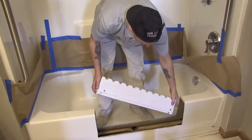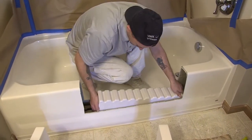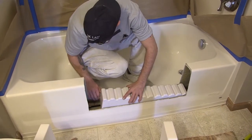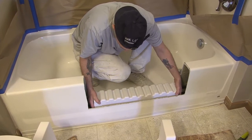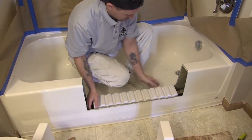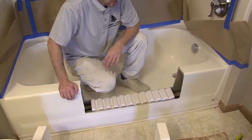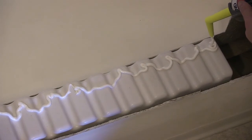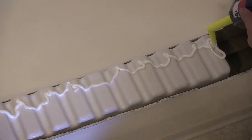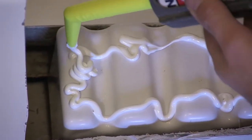Place the SureStep product into position once more to inspect the fit and position — this is the final opportunity to make any adjustments if necessary. If installing the SureStep Combi, install the waterproof wrap membrane after completing the support structure assembly. This step does not apply if you are installing the SureStep Mono or Mono Low. Apply adhesive to the top of the large support box. It is recommended that an extra bead of adhesive be placed on the ends of the support box where the step curves upwards.